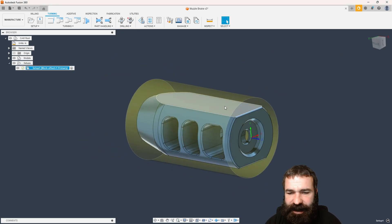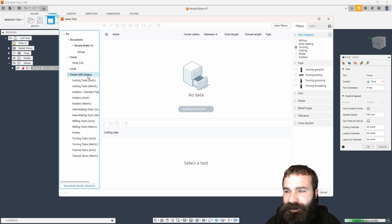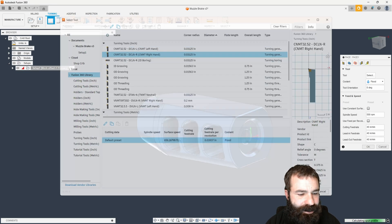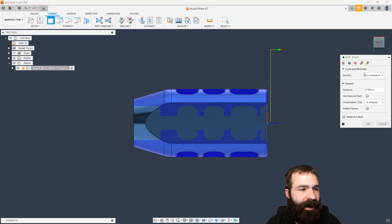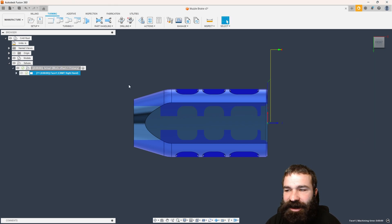I'm actually just going to keep the stock the same as always. I don't really mess with the stock until I know my stock size. Given this is more of a training system, the stock isn't super important. So the first thing I'm going to do, like anybody would, is we're going to go ahead and face this off. I'm going to go to the default library — just a good old CNMT right-handed tool. It's picking up the front of my part and facing that off. We're going to throw on multiple passes as a precautionary in case our stock size changes.